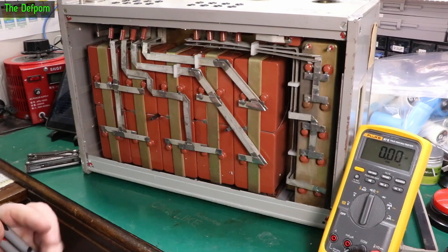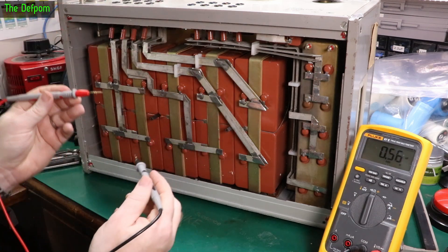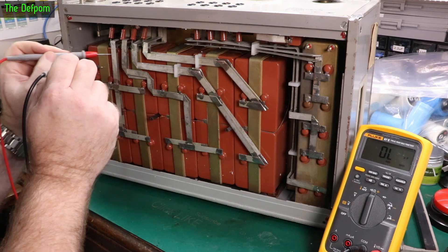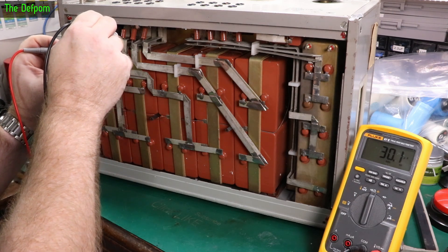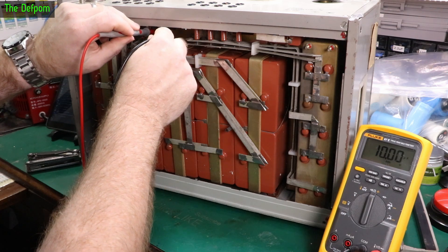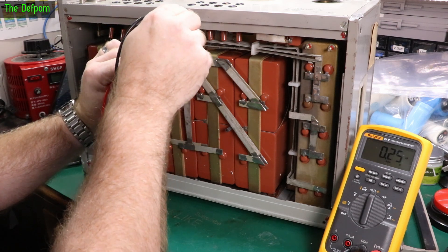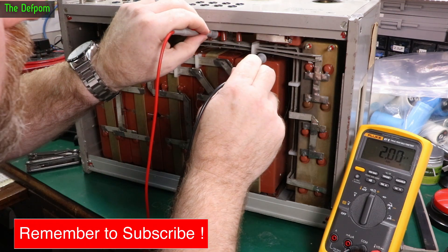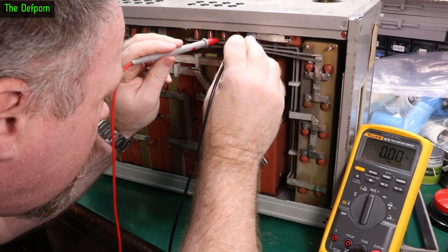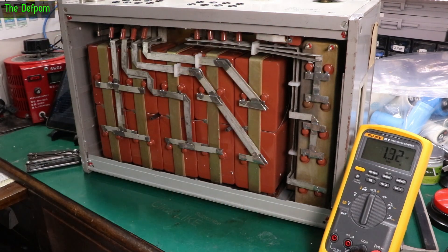I think I should try measuring capacitance again. So let's measure the capacitance from the inside, because then we're definitely going to get good connections. We'll do this one first which is the 40. There we go - 40.1, just measuring it. Then we'll do this one here - that's 30. Yep. 20. Yep. 10, which is the one which had the rail issue - that's perfect. So we've got 4, which is good. 3. 2 - is there. Yep. And 1 is here which is a bit tricky - there we go, there's the one. So they're all working fine - no more shorts.